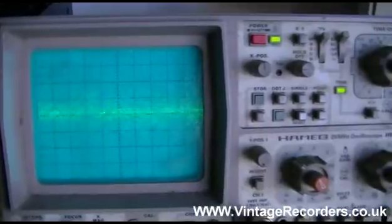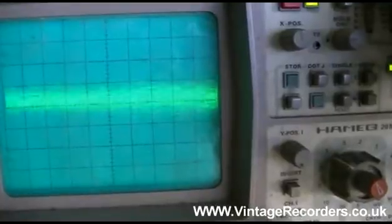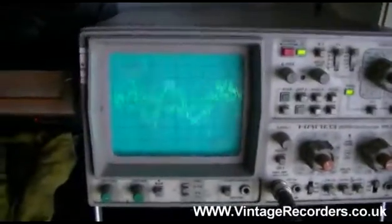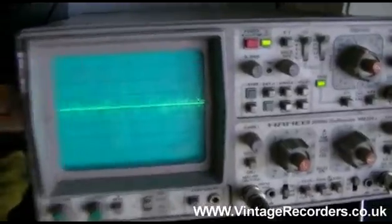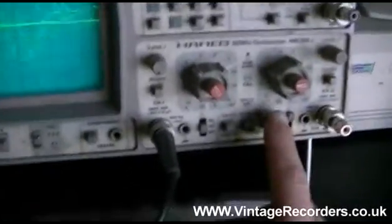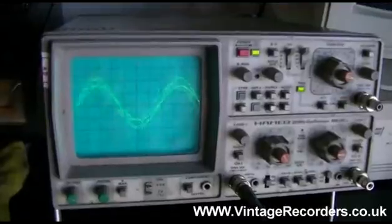Then I had a look at this — it looks like an audio signal, but what you can't see is it's sort of pixelated. If I speed up the time base, you can probably just make out that it's actually little blocks. If I turn down the left-hand channel, both channels are coming out the same output. There's only one wire plugged in, and if I put the two channels on, now I've got three. So that proves the digital-to-analog converter is working.